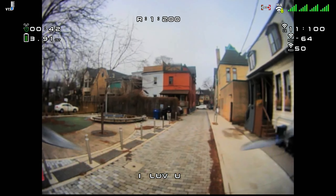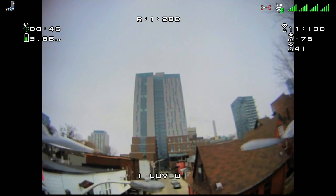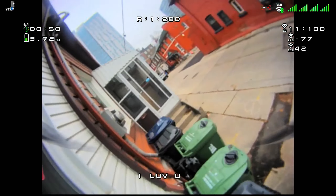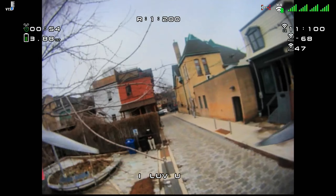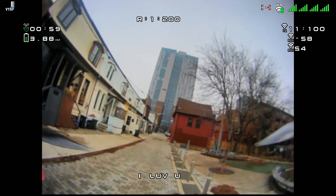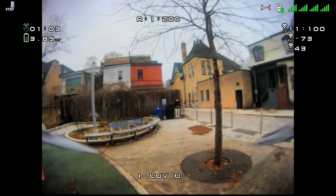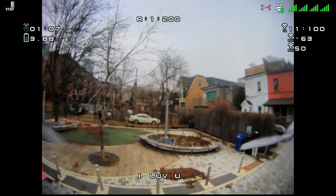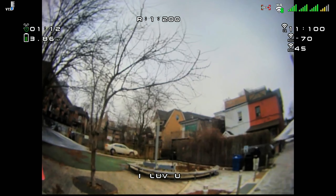I'm using the Fatshark VRX, just so that you know. And I'm using the 90Hz cam, which is not compatible with the Fatshark VRX. If you have the HD Zero goggles, great. But in this setup with the Fatshark VRX it breaks out differently — so in just the regular 720p 60 mode that you'd fly in, you'd get the breakup gradually, so you can kind of tell when it's going to go. But I'm noticing a stutter because it's stuck in 90Hz mode.